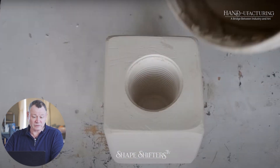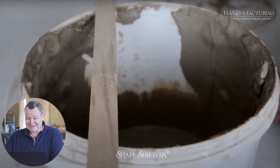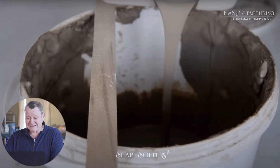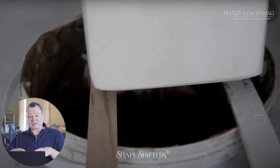They're going to cast it right away, so we're assuming the mold is dry. That's lumpy slip. Casting slip is something your instructor will help you with, but this is a commercially bought prepared slip. It typically gets used and then put back in the bucket — it's a DIY scale project, so it's okay. This technique is fine. The thing is, if your mold is not clean and you reposition the mold directly over your casting bucket, you can get bits of plaster that fall into the slip, which is not helpful for a few reasons.